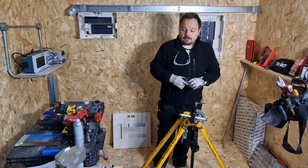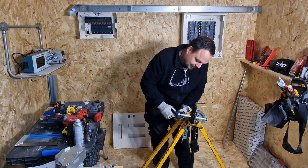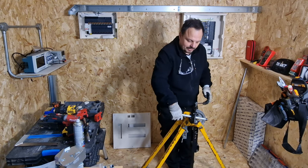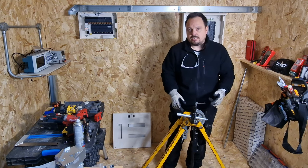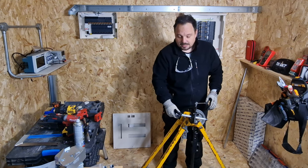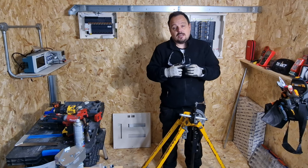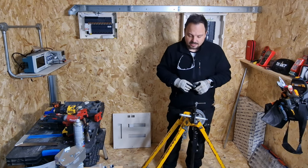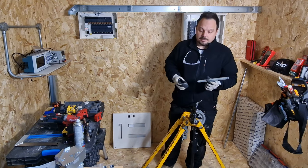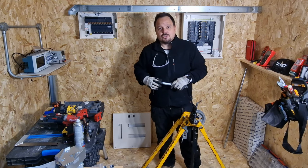You can see we've got a nice thread on there now. I'm just going to drop this coupler over the end just to make sure it's actually going to work before we get too far along. You simply twist that on - it should go on pretty smooth because there's plenty of cutting compound still in there. That's gone on nice. When you come to join into your metal clad back box, it's best if you use a coupler on the top and put a brass nut into the end - I'll show you that in a second - and then you've got a solid connection into the box and you're not going to catch any of the cable edges as you come to wire it out.